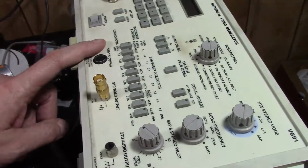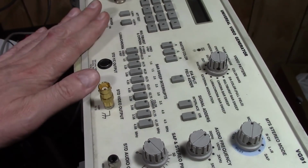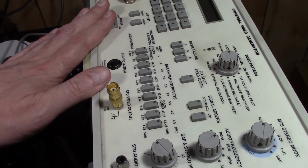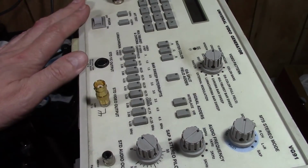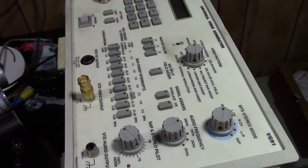And likewise, your signal generator. Modern digital ones stabilize pretty quick, but if you're using a vintage tube-based RF generator, again, let's say at least 15 minutes to let it really warm up and stabilize.